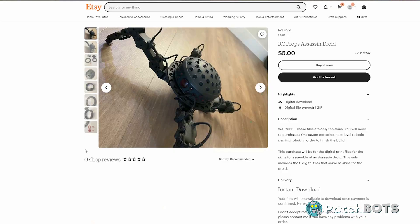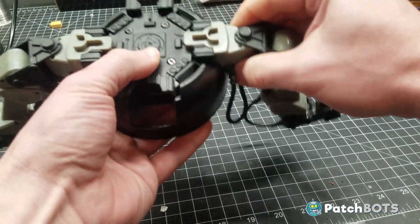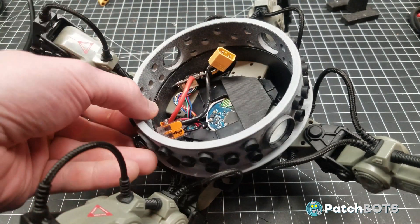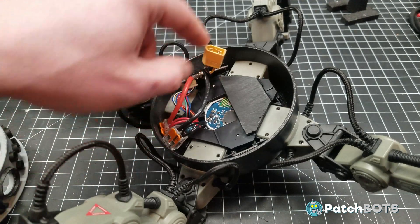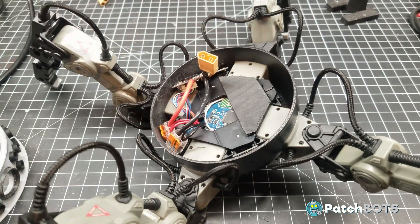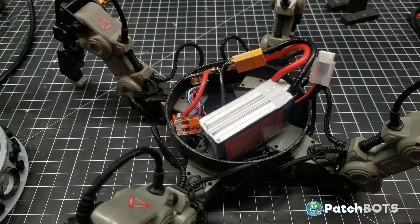On to the 3D printed parts. These files are available for purchase from Matt Hobbs' Etsy page — I'll put a link in the description. There are four main structural parts. The round one fits over the main hub and the legs pressure fit it into place. The wiring turned into a bit of a junk show because when I resoldered everything back onto the battery board I just put it into some WAGO connectors. For the battery, I soldered an XT60 connector onto the main battery port, and we're now using a battery with an XT60. Plugging it in, the droid boots up as it should — we're good to go.